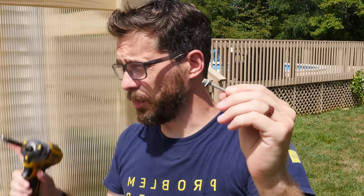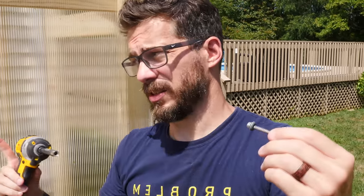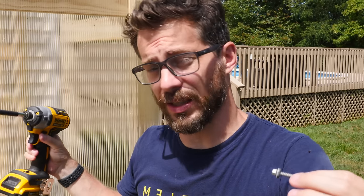We've got these roofing screws that we're going to use to put this stuff on. Each has a washer and a gasket, and in this case that's really going to help avoid crushing the plastic as we screw them in.